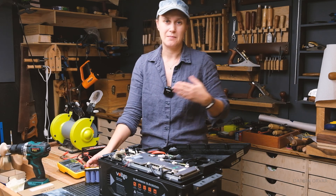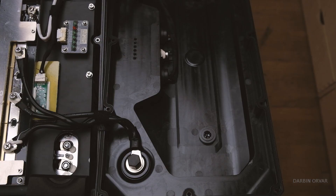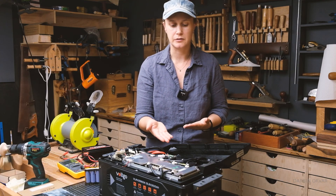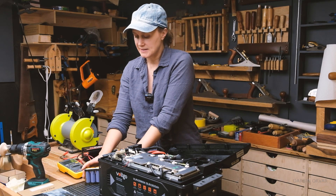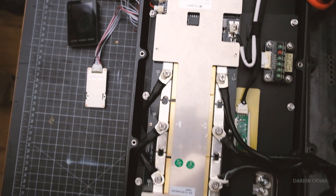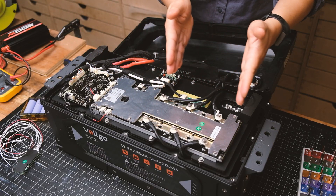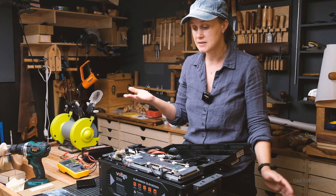What does the BMS do? It balances the cells in the batteries to ensure the voltage is the same throughout — you don't want different voltages in different cells. This is a matter of both safety and the longevity of the batteries. There's also a reader in the app that measures the amps going in and out to give you a capacity reading — how much energy is stored. The metal on the BMS dissipates heat, acting as a heat sink. The cell balancer is the brains of the system, and under here we have four cells connected in series, which is how we get 12 volts.